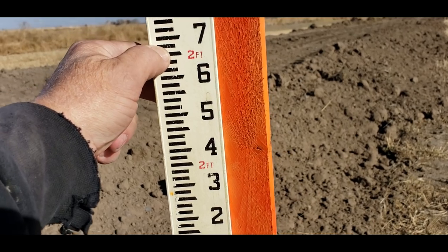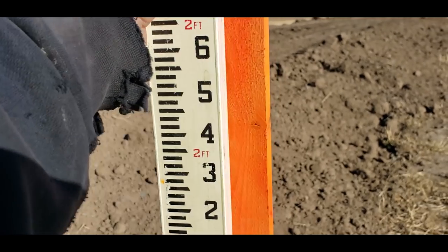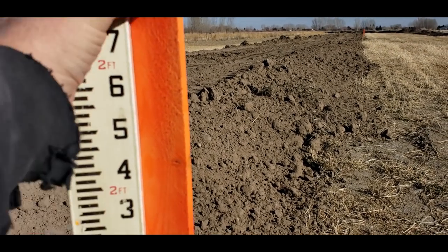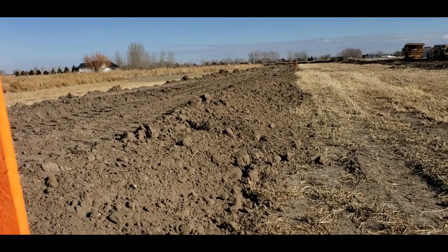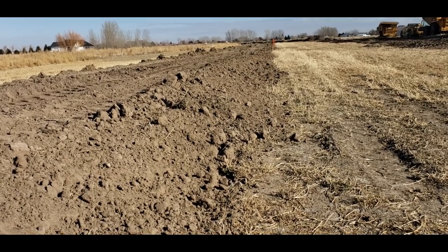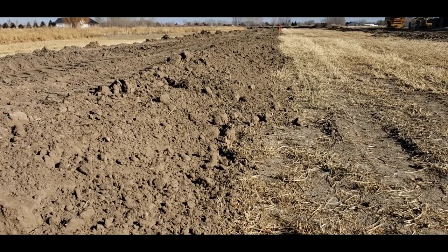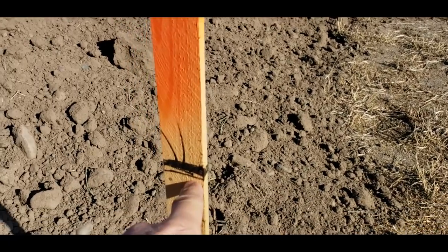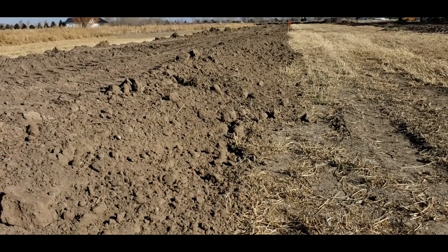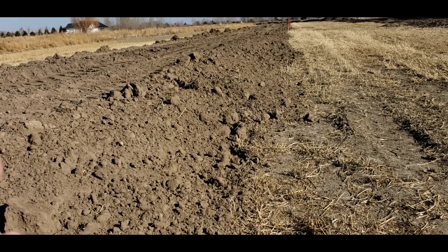So tenths are a lot easier to work because they are like metrics. They're in, you know, increments of 10. So anyway, this ditch has 1/10 per 100 fall, and that's pretty good for an irrigation ditch. 2/10 will really make the water scream, but this one has 1/10. So when you engineer them, what you do is you put the top of the fill at water grade. So this black line is water grade. And when I get in there to V it out, that will generate the freeboard. That'll give me about a foot or better of freeboard, depending on how big I cut it.